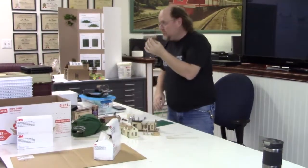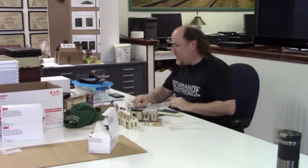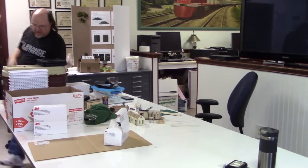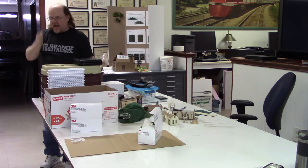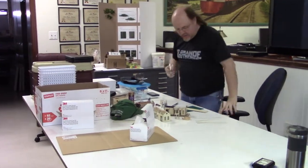Your overhang. Once you've done a few rows, I go ahead and trim the overhang off. And I really like to do it with a chisel blade, just because I can kind of guillotine straight down onto it. You could do it with another one. I just really try to avoid dragging a knife across there because it tends to want to grab the row of shingles and start yanking things loose.